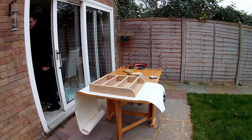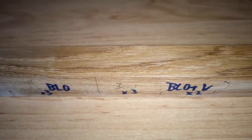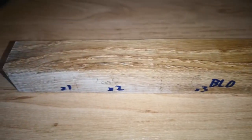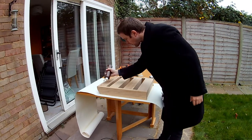Now that I'd sorted out the shape and got everything assembled and smoothed, it was time to put some finish on. I'd done some tests with one of the offcuts whilst waiting for the wood to dry, testing to see how boiled linseed oil, varnish, and a combination of the two looked. I decided that the more matte look of the oil was more suitable for the slightly rustic looking spice rack, compared to the very shiny glossy finish from the varnish. So I grabbed some tissue paper, splodged on some oil and started to rub it in.